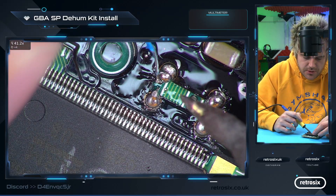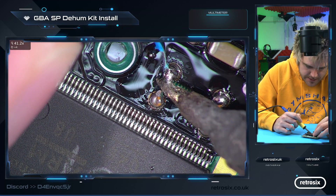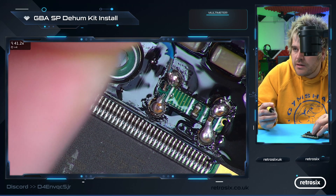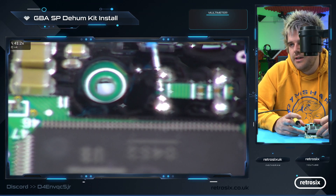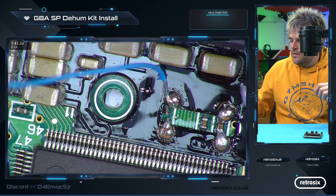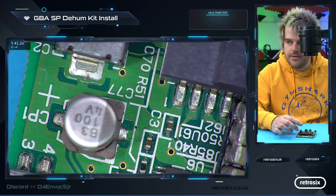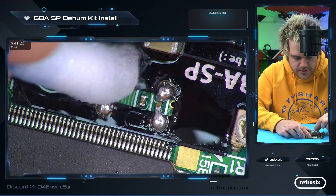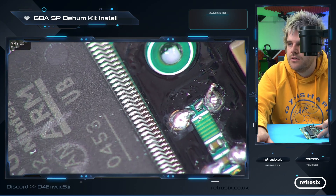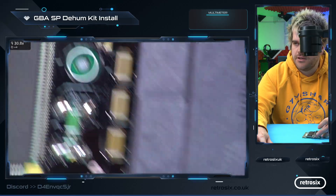Normally you wouldn't have to do that — this is because this board is actually missing a capacitor. You've seen how it's much easier to solder when there's a capacitor there. Don't worry too much about knocking off the capacitors because the board actually adds them back to the system — it adds more than it originally has. That looks like it's on there. I'll trim it and clean this up with IPA, and we can see we've got the solder joint onto the pads and solder onto the capacitors — so there's the tricky part done.